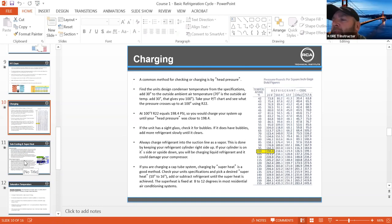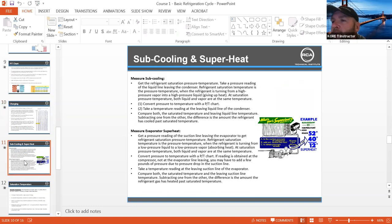For you beginner guys, you need to understand refrigerants. If you can study anything right now, know your refrigerant and the difference between a blend and a pure refrigerant. When dealing with these refrigerants, you get a knack for the characteristics. That's really one of the biggest and most difficult things as a newer technician — it was hard when we were dealing with three, and now we're dealing with 30 plus. They all have different characteristics. You need to understand what it means if you have a glide or a blend.